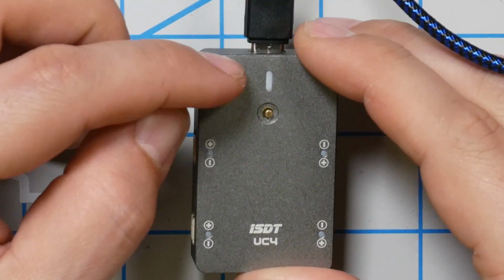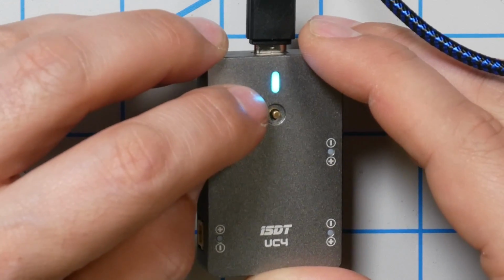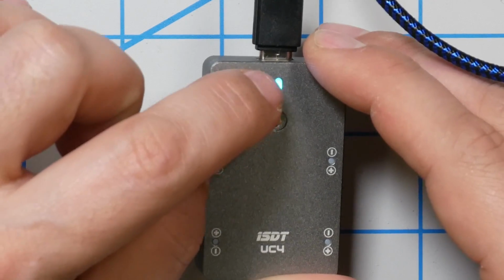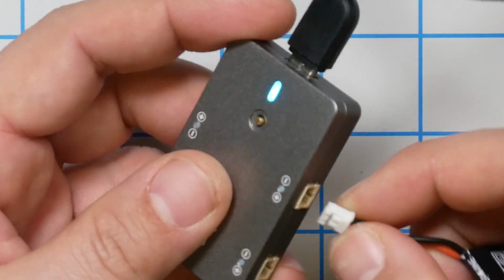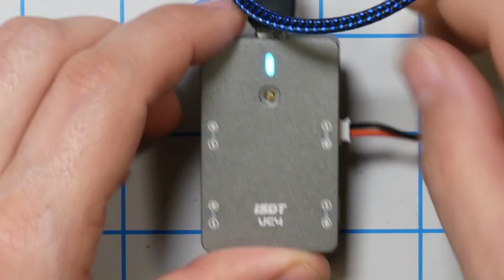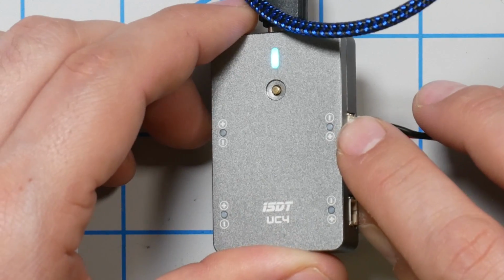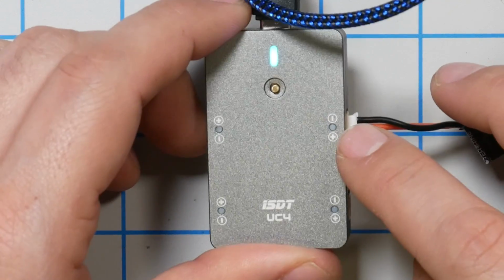The LED gives us the status. When the LED goes solid, it tells us that we are using quick charge as opposed to just a standard 5-volt 2-amp USB. If it stays flashing, the batteries aren't going to charge as quickly. And we can just plug these batteries in. It can charge at 500 milliamps, 1 amp, or 1.5 amps, and that is configurable using this button. And the little status LED here tells us the charging status of the battery, whether it's empty, middle charge, or full charged, and how fast it's charging, I think.